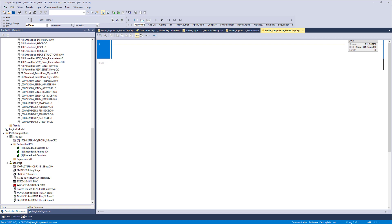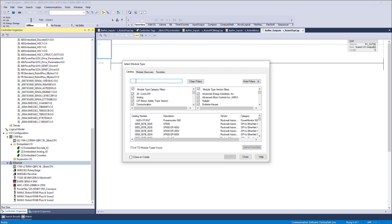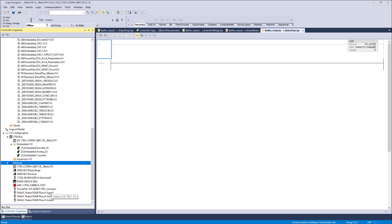That's how information gets back and forth between the robot and your controller. To add a FANUC robot to the I/O configuration — you right-click, new module, this dialog comes up. You type in 'FAN' and there you have it: four types of module-defined data types given to you that you don't have to create yourself. We want the R30IB+ because that's the controller we're using. FANUC robot R30IB+ — that's all there is to it. You add them in and give them names: SCARA1, SCARA2, and SCARA3.